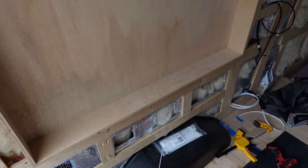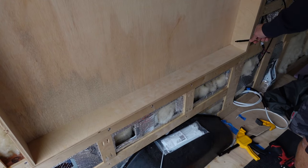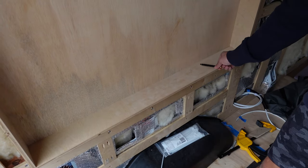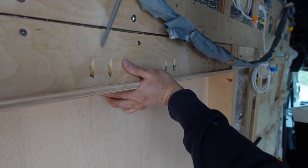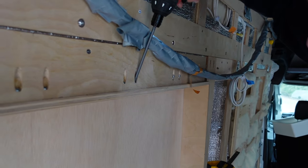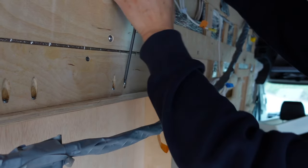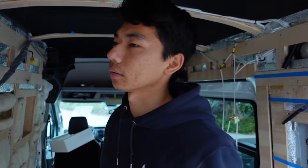Our whole board is 42 and a half inches. We're going to start at the corners, go one and a quarter inches in on each side, which leaves 40 inches in between. A nice round number to divide that by is 10, so we get four sections with three screws each. These are some nice pocket holes — wish I had thought about it for everything. Lesson learned: pocket hole from the beginning, pocket hole everything. It takes planning — invest in a Kreg Jig earlier.